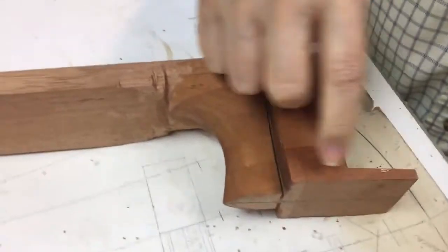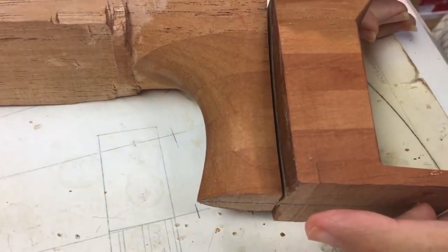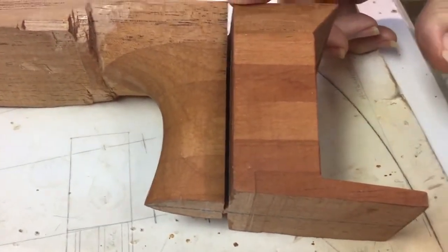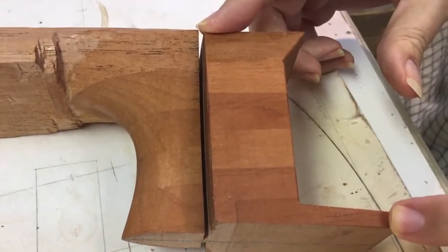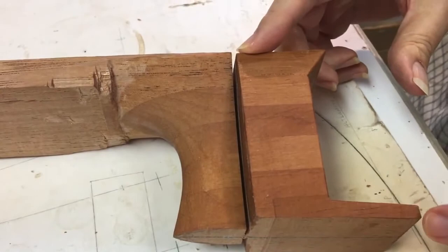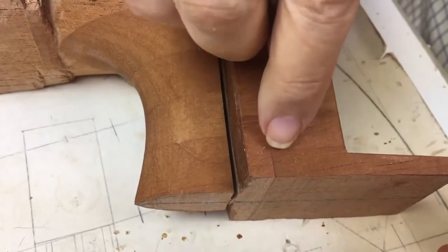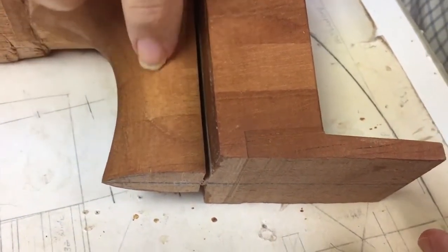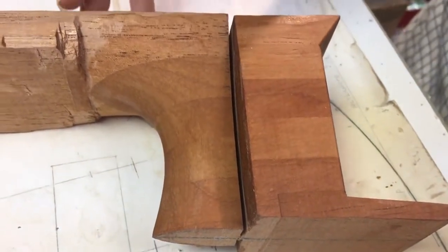by piecing this down here to make it shorter this way, because it comes in a little bit longer, like about this, and it's just too large, because when I cut it down, then the heel right here disappears. So I had to piece a heel right in here, part of the heel work inside the guitar for extra support. But it seems to be working just fine. I pieced it from this point here to down here like this, rather than going into the heel itself. This way I maintain an even coloration on the heel outside, and everything seems to work okay that way.